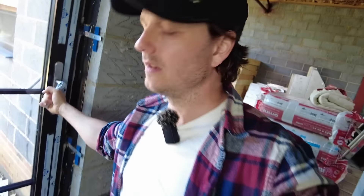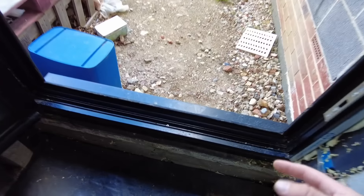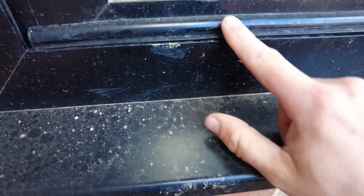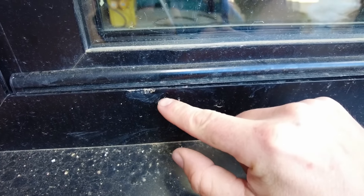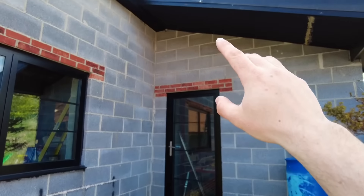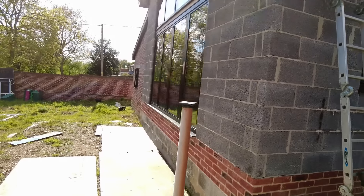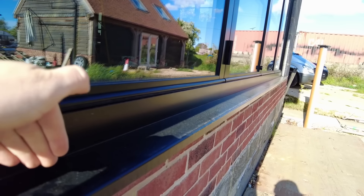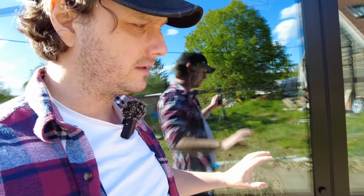With this manufacturer there's two different types of seals depending on whether they're opening in or opening out. Mine were special order because I wanted 175 width, and the opening-in ones — the seal at least wasn't quite right. This door here, you see that high edge — that's on the opposite side. By the time you close the door, even though you've got this drip edge here, it doesn't extend quite far enough to get over that door, and you've still got these little gaps. The rubber seal still lets through a little tiny bit of water.